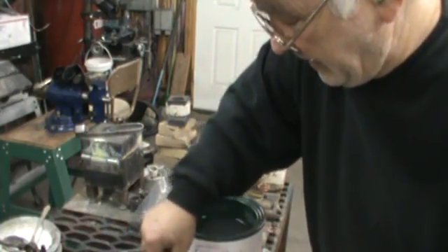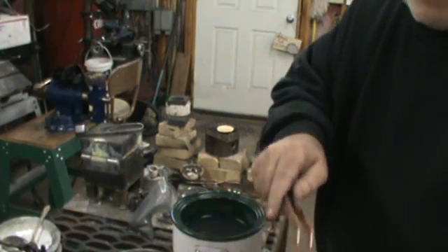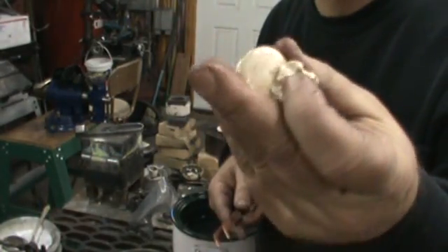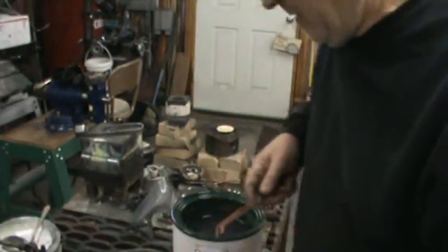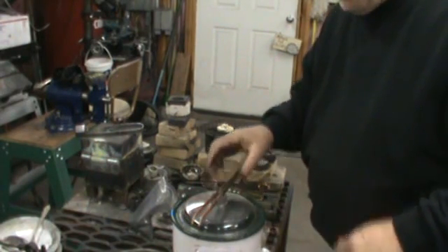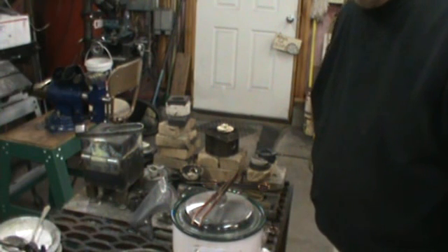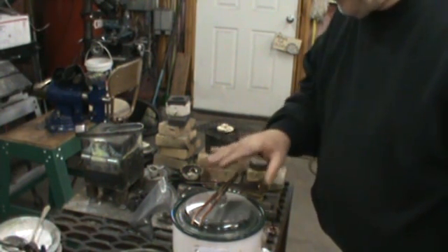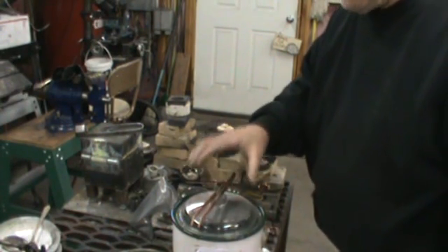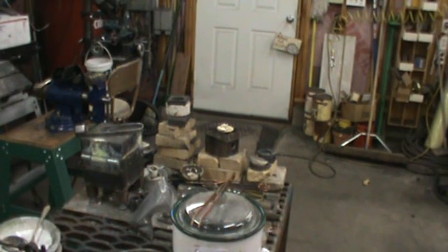As black and ugly as that was, I still got a little bit of flux down in these crevices — if I'd left it in the pickle longer it would clear that up. But that took a really ugly piece of fire-scaled silver and turned it out nice and clean. That's the pickle pot — you've got to treat it with respect. Do not get any metal in there other than gold, silver, or your copper tongs. Stainless steel will ruin the pickle. The biggest problem is forgetting to turn it on or forgetting to turn it off. This pickle here, I'll be using it clear through the summer. Anyway, that's pickle and some of the things you can use it for.